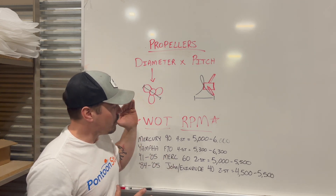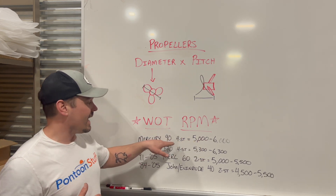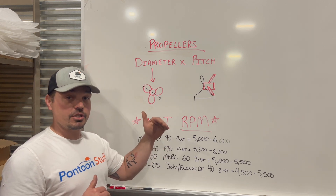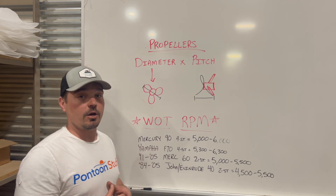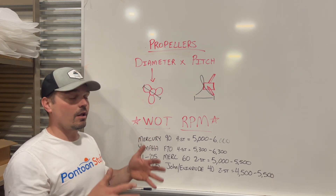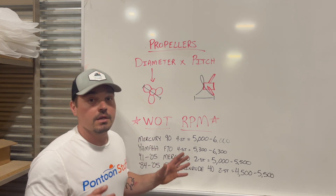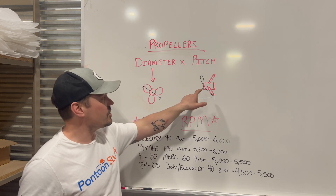When it comes to fine-tuning: say I'm running 4,800 RPM with my 90 four-stroke — I need to get my RPMs up quite a bit. Every inch I go up in pitch is going to lower my RPMs at wide open throttle about 100 to 150 RPMs. Every inch in pitch that I go lower, I'm going to gain RPMs. Think of it like shifting down in your car — you hit higher RPMs when you drop from third into second. Your outboard doesn't have a transmission, but we can adjust that RPM range by the pitch of the prop.